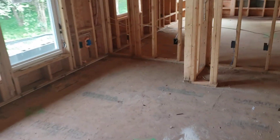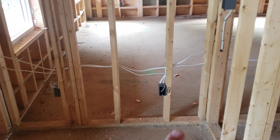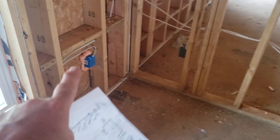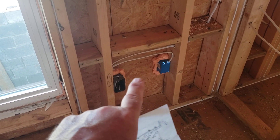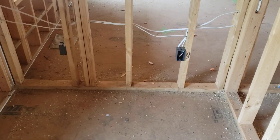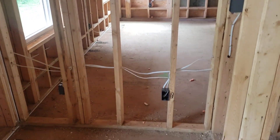Now on the built-ins, all the wiring has been put down low. A customer was asking to put some cabinets in here. Reducing the depth of the cabinets to 21 inches is what we're going to recommend. This is 25 inches to the side of that box, so 24 inches is still not going to touch the outlet cover but it's really close. Making these cabinets reduced depth or ordering them as vanity base cabinets at 21 inches is a much better option. These outlets are low, and if they were up higher they would actually be in the cabinet line.